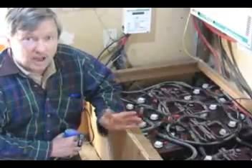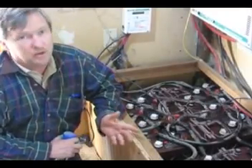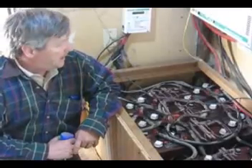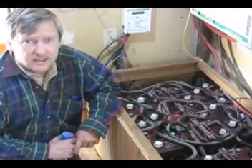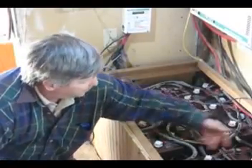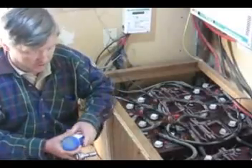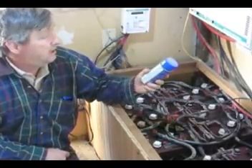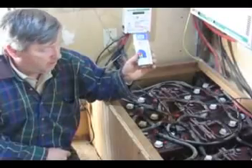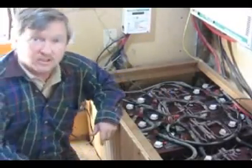As you've read, I've got a worn-out battery bank here, and I need to replace — I'm going to remove just the dead cells. I believe that was five dead cells. One of the things I'd like to point out here is this red stuff. It's been five or six years, no corrosion. This battery corrosion spray that we got from the auto parts place worked really well, and that's why all my connections look red.